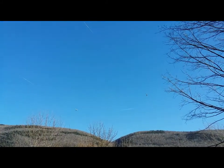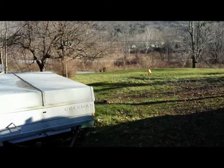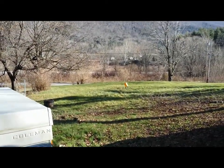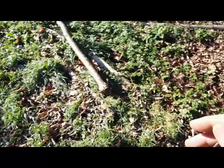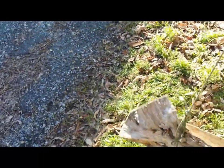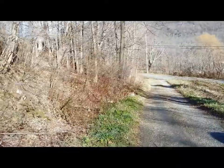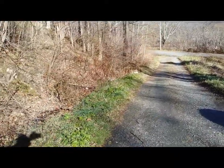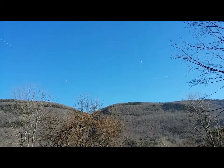But this antenna is basically two driven elements, exactly the same length, using a phasing system. I will post a description of the phasing system and how I have it working, and I'll also post an SWR sweep. There's a control box out there. The corners are on blocks of wood on pulleys through the trees so they free-float as the wind blows — the wind's really cracking. There's another set down there you can see in the grass, which prevents the antenna from being torn apart in the wind.